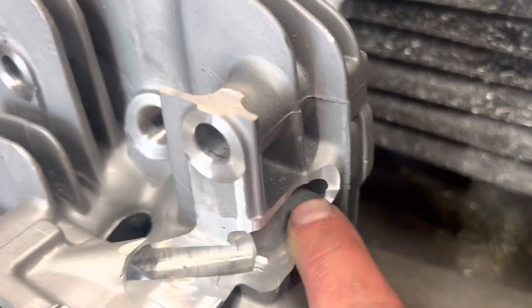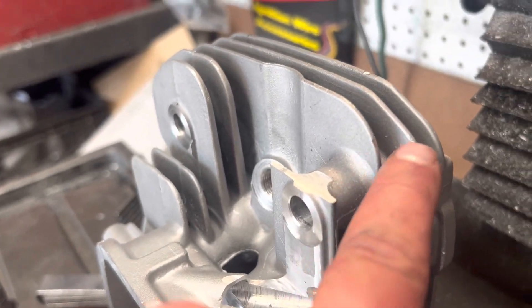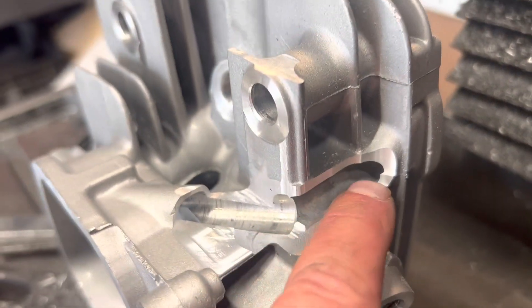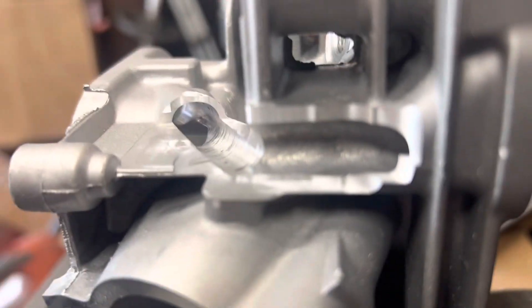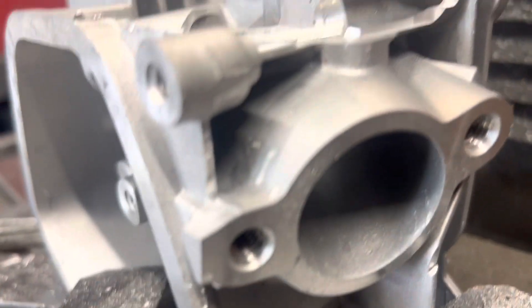We've pretty much finished up the cut. This is what we're left with — we've opened it up so we can see inside these oil paths here. This back corner got a little tricky because these fins kept hitting the curved part of the quill. We were able to mill this one down, but I wanted to leave the others so they match up with the block. As I got deeper it started hitting — it was like a taper — so I couldn't go as deep. Now we can fill this all solid and take that port and bring it that much wider.